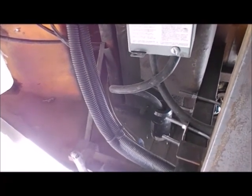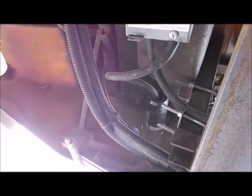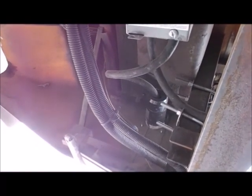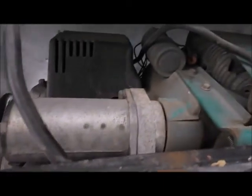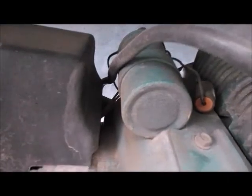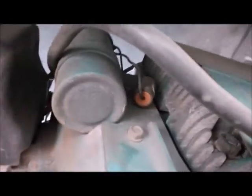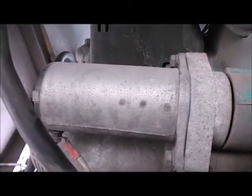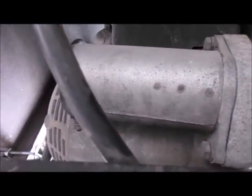The reason I did that is because typically you can only run one air conditioner at a time off of a 30 amp. This is a 6.5 generator. On the back there is your ignition coil and the capacitor, which goes bad sometimes on these units. There's your starter if you ever have to work on it.